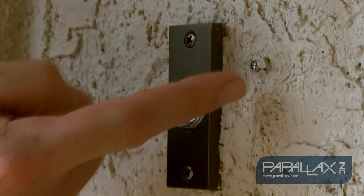Here we are outside and I'm standing next to where the two sensors are. There's an LM34 for the temperature and a photo transistor just for the light sensing. They are right here — I put a little hole and put them outside and then covered them up with some paint. Since it's really hot outside we got a real high temperature, so I'm going to grab an ice cube, put it on the sensor, and watch the temperature change.